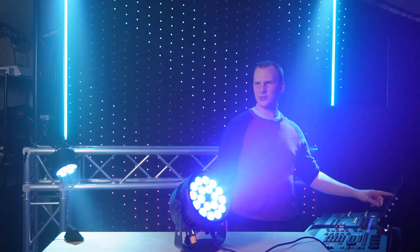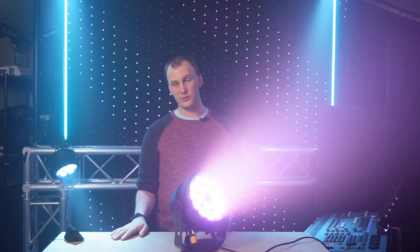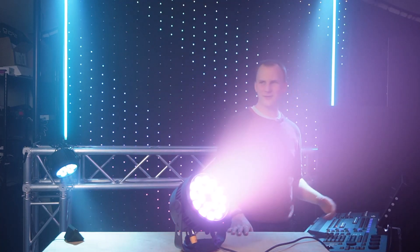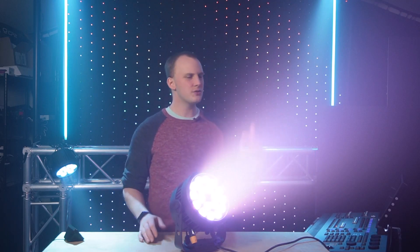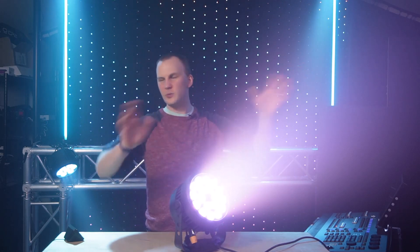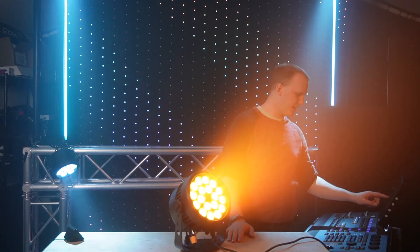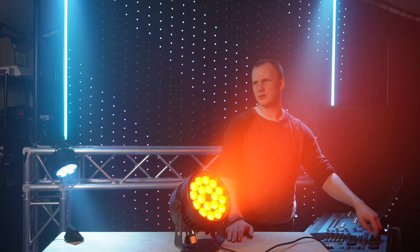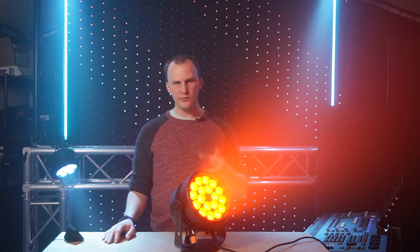Using our color picker, we can get a whole range of color. If we bring all the emitters to full — red, green, blue, white, amber, and UV — we get actually a pretty okay white. It's a little bit pinkish, but pulling the UV out cleans it up, and trimming red a little gives us a nice clean white that I'd feel good about as a front light in some spaces. It's washy, not super focused — it does the job of a wash light pretty darn well. We can also dial in a deep amber that looks really good.